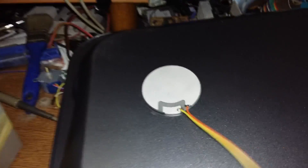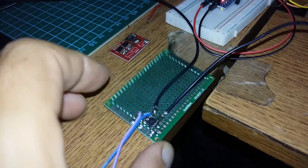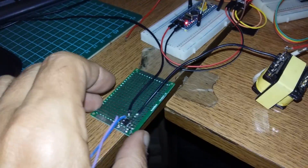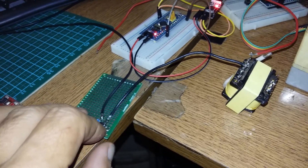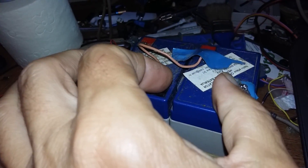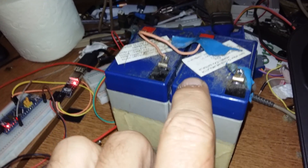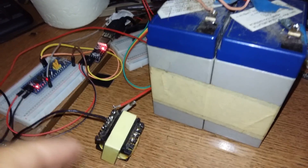But what happened — I tried to drive it with a small MOSFET from an ESC (electronic speed controller). And it burned one, and burned two. Because it was working on six volts, but that was before I recharged the battery. So it worked, but only for one second.